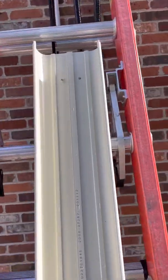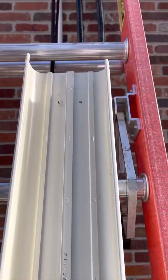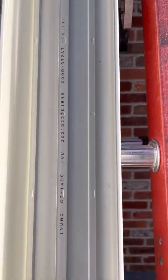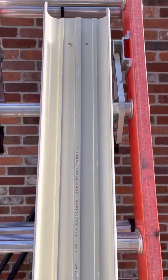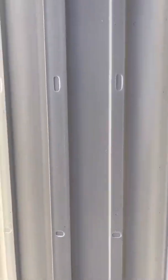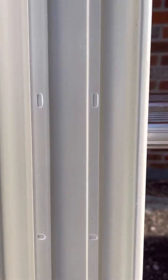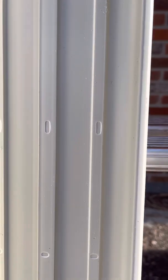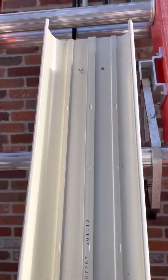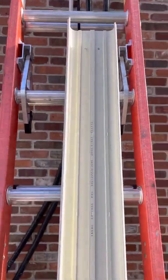Basically what I'm doing right now is I put two little pre-drilled holes in this. I don't like putting it in just one spot — I like going two down and then a little bit further, about every couple of feet. They do make pre-manufactured knockouts but they're kind of big sometimes for screws, so we actually make our own in the flat part and use fender washers to pinch it down.